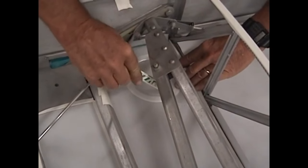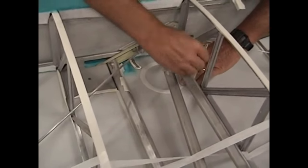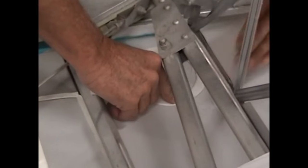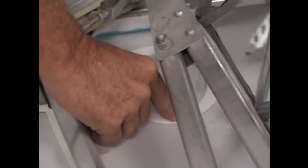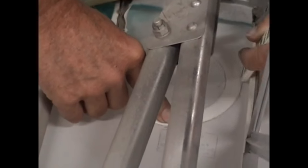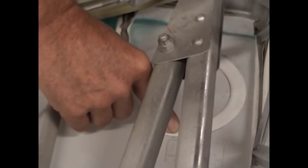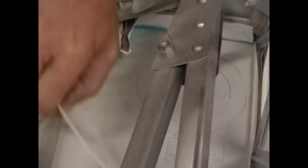These soft lead carpenter pencils work quite well — they hold an edge for a long time and you don't have to sharpen them too often. It's not a good idea to use ink because some inks will bleed through your finish. You really don't want a nice pretty yellow Cub with pencil lines showing where all your rings are marked.